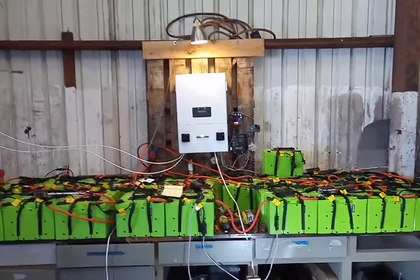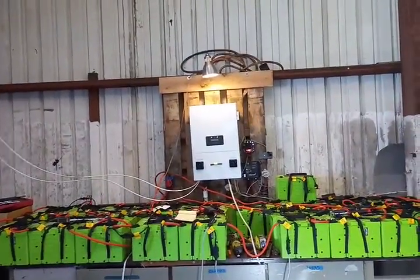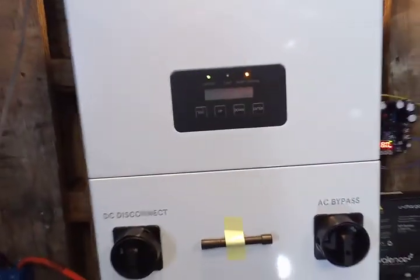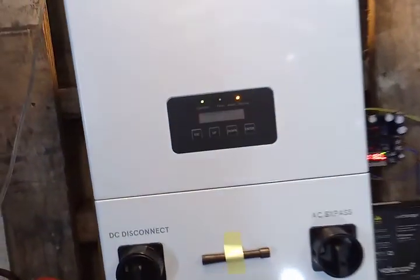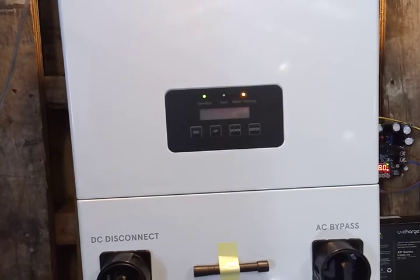A few days ago I told you guys about this Tesla discontinued Powerwall inverter that I was experimenting with to see if I could make it work with non-Tesla brand batteries. So far the first day it was actually working — it was pulling power out of the batteries, working great, powering the shop back off the batteries, and also exporting 6000 watts from these batteries into the grid, which was kind of funny because the manual said it wasn't going to do that without permission from the servers.